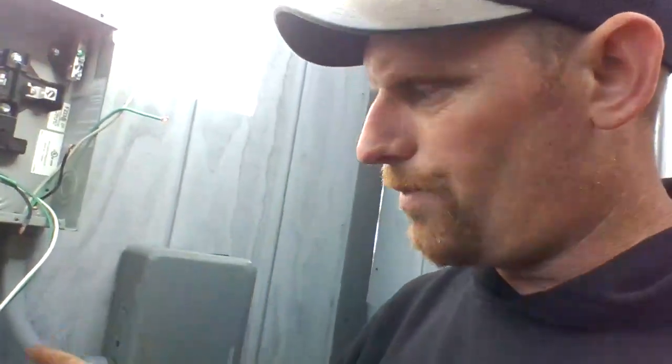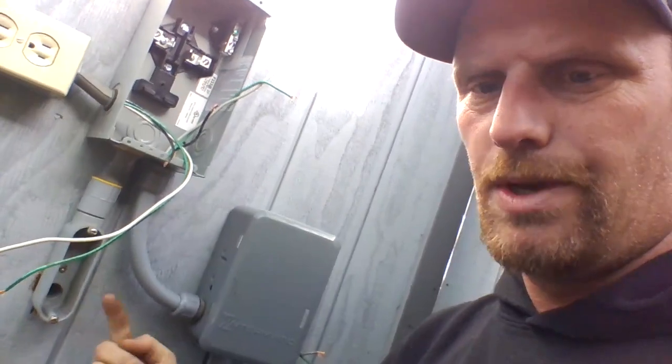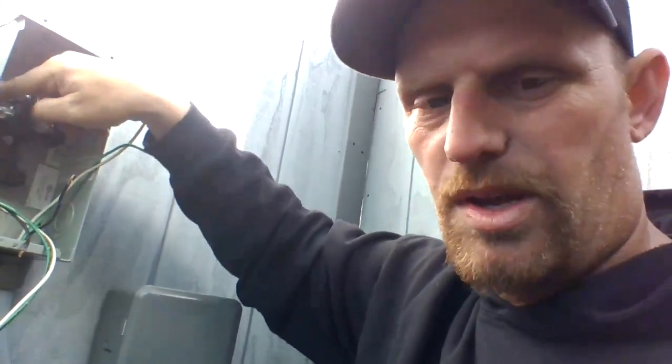So, in the LB right here, the conduit that I showed you at the beginning of the video, we got to pull wire from the panel. Do I want to do it from the panel? No. I'm going to do it from right here. Well, inside. I'm going to pull wire through, and we'll stick it through this way, through here. And it'll go up in the bottom of this. It'll apply the power on here, and then a jumper wire to jump to the other side.